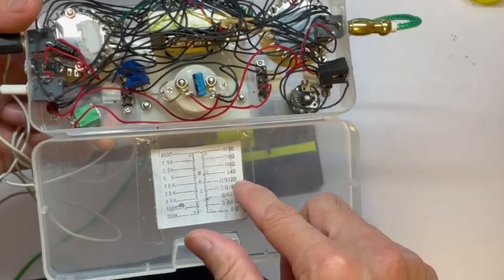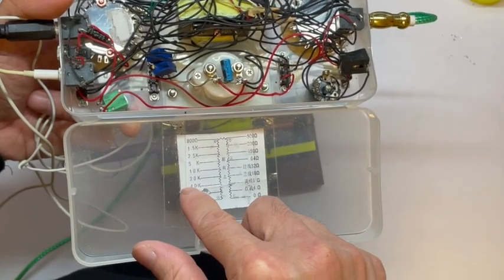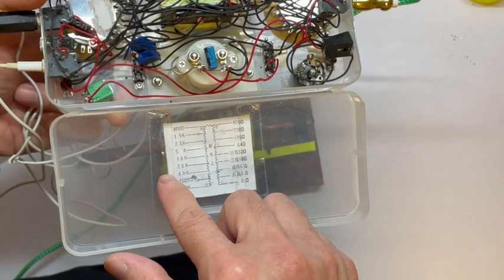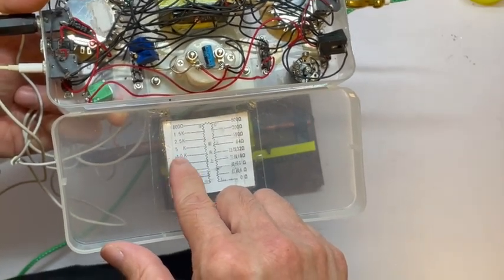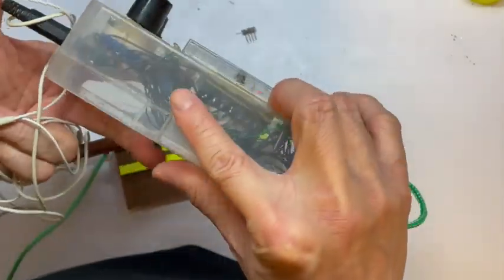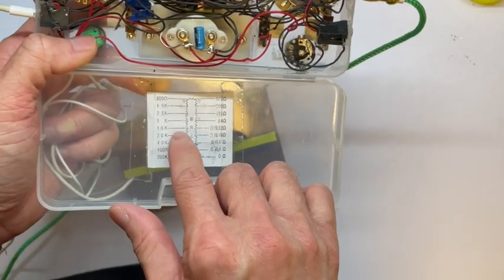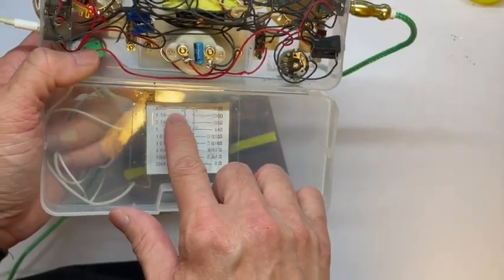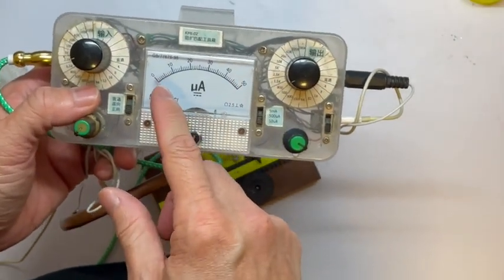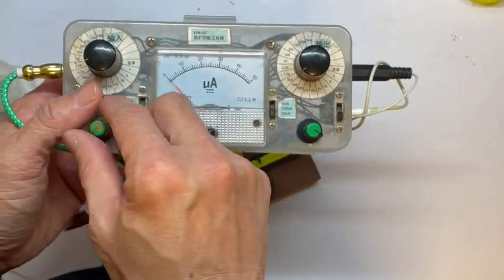Some of you may be using a standard headphone which is 32 ohm. Some may be using the crystal headphone — what we call the piezoelectric headphone. Those headphones have high capacitance and also very high impedance, and can be in the 10K ohm area, so you can connect 10K ohm for those headphones. And for the input impedance, if you are using the MOSFET 3DQ, the input impedance is around 2.5K or 1.5K depending on the frequency. This meter will allow me to see the signal strength by showing the current in microamperes that I can receive, so I can look at this to determine whether I have the right tuning.